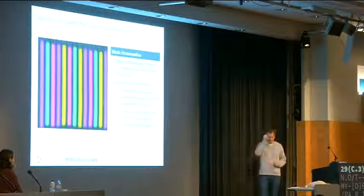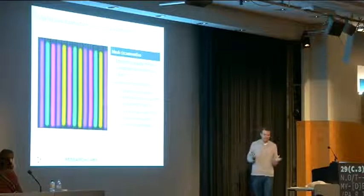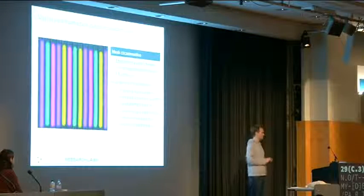Some other chips, a different family, take a long time, and it's a magic to me why a chip can take so long thinking about whether the mesh is breached, but it takes a couple of thousand clock cycles to decide, yes, the mesh is breached. And that's enough to execute some part of the attack. Reset the chip, then execute the next part of the attack.